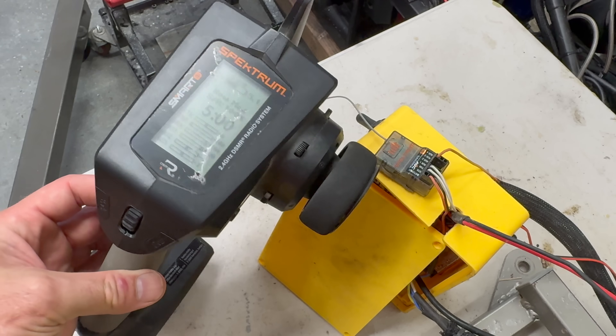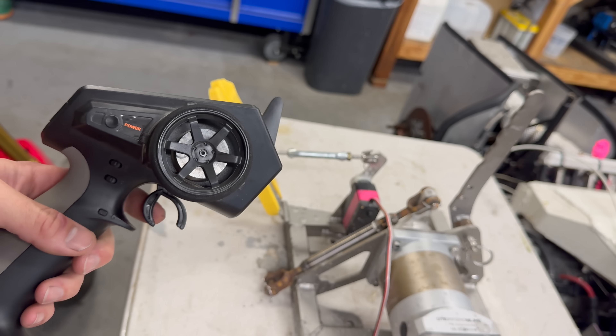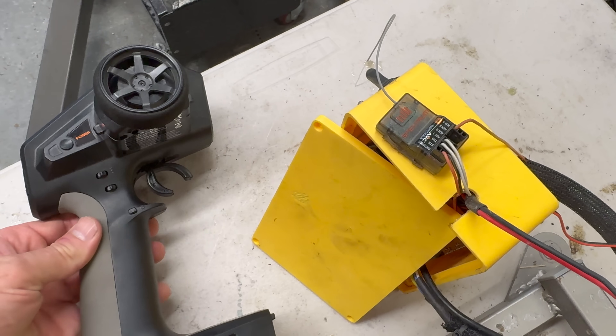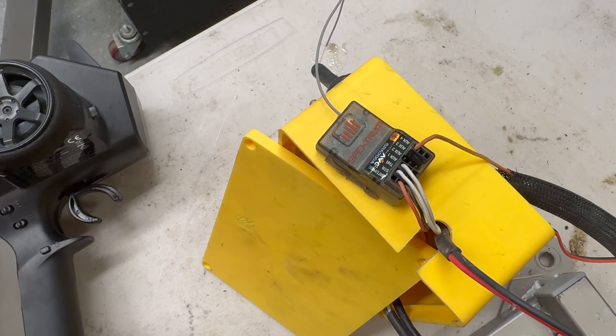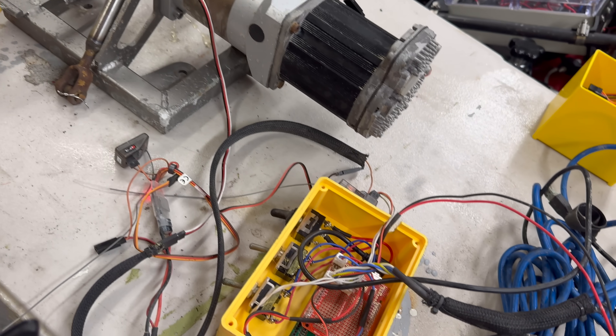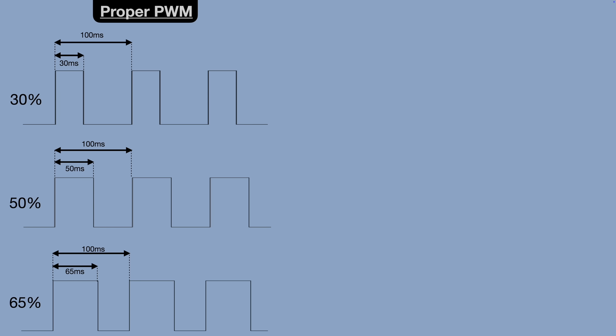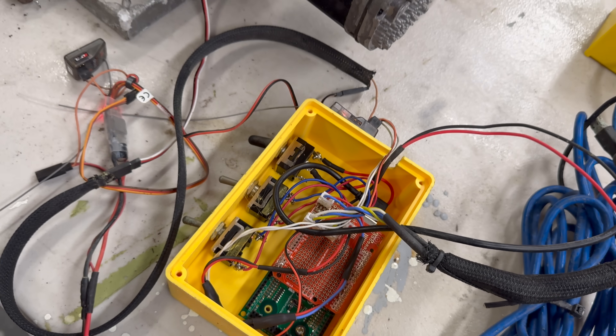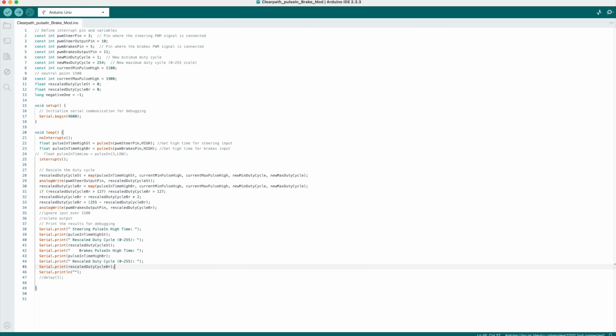The transmitter is just a part you can buy at a hobby store for any RC car. It comes with a receiver that takes the inputs from the transmitter and turns them into electrical signals. For the accelerator, these are standard parts that are made to work together. But for the big servo motors, we need an intermediate translator. Both the receiver and the motor use PWM to communicate. PWM is a signal that switches on and off really fast. The big servo motors look at the ratio of on time to the total time, but the RC receivers and servos only care about the length of the on time. So it's enough different that I had to put an Arduino in the middle to translate from one PWM signal to another. Here's the code if you're trying to do this to your own Smart car.